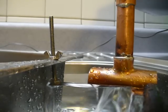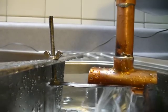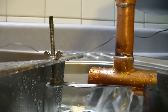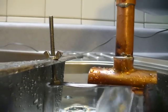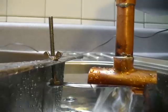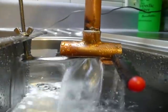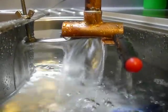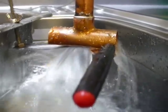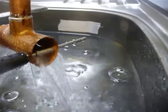And a third tube added. Okay, now I've added a third. So this comes out to about an 80 or 90 gallons per hour flow rate now. And you'll see that the flow is keeping up. Water levels drop a little so that the valve can open more, but it's still maintaining a pretty good level.